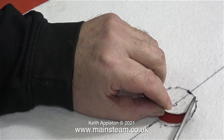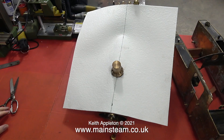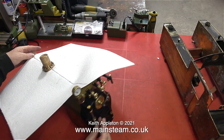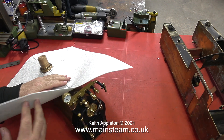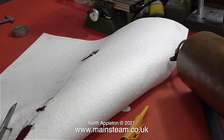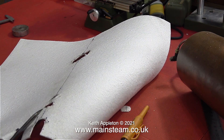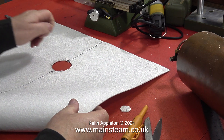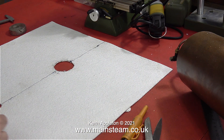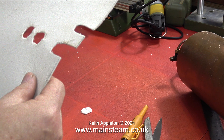Once I'd drawn round the piece of metal, I just cut it out with an old pair of scissors. I managed to cut the hole and it fits very well over the bush around the base of the steam dome. I haven't marked the positions for the safety valves because you don't need to do that — all you do is press hard on the ceramic material where the safety valve bushes are, and you get a perfect imprint. All that's left to do is to cut the two holes for the safety valve bushes, and two slots — one to accommodate the turret, and the other one to accommodate the water gauge extension.